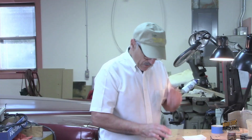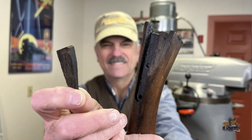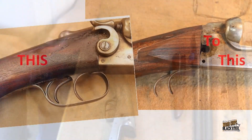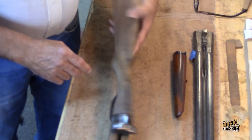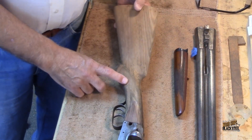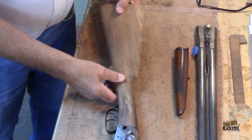There was a lot of things wrong with this. The inletting was cracked in several different directions. There were broken ears, so we've repaired all of that. We had to rebuild or reconstruct these side panels — those came out really nice. We also had to re-checker: we pointed up the checkering on the left side and then ended up having to recreate the checkering on the right side. So we've gotten that done and it looks really nice.